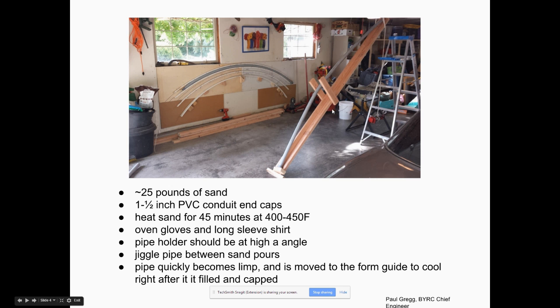I had four shallow pans and poured each one in — it takes a couple of minutes. You need to be really careful. As soon as the 400-degree sand heats the pipe, once it's about 170 degrees Fahrenheit it starts to get really limp — like a big noodle. You want it on the form by the time that happens. If it gets too limp you really need two people to carry it.